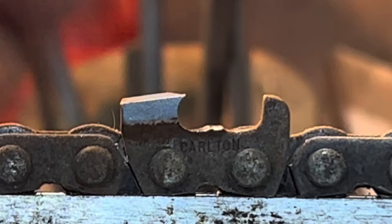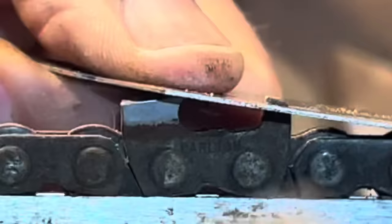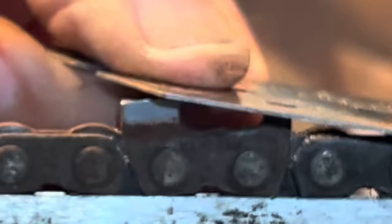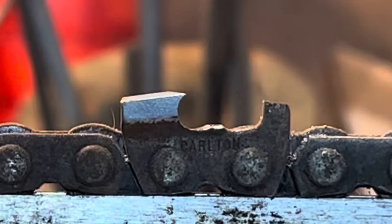And then after I do that, you'll see me go like this - and that's not aggressive, friends. It's not. That's a whole bunch of gullet left there but that will cut - it's just not where I like it. So that's why you always bend over, take a look at it, see what you've got on the go. Let's get a little more gullet out of that so we're grabbing a pretty good sized chip. See the chips flying off of that? Ease up on your file once you're in the hole again.